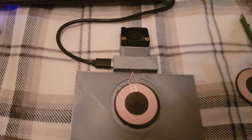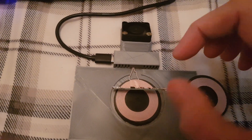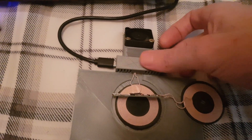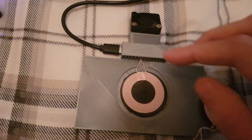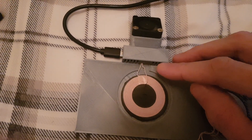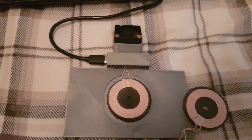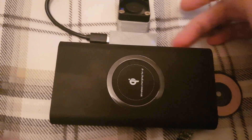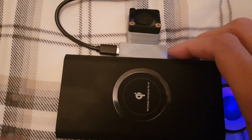I've actually made some adjustments because this board was a pretty tight fit in there, and with the heat sinks on as well I was unable to put the back on, so I had to put a piece of card on it just to help with the airflow — you want it sealed underneath to direct the air out the front. I'd probably put a slight increase in the length of the top part to give it a slight angle, because if you're putting a phone with a phone case on there's a good chance you could block the vents.